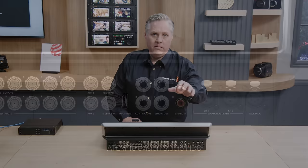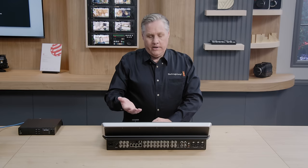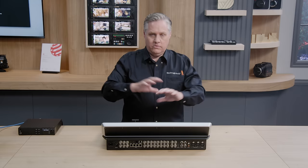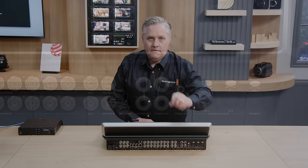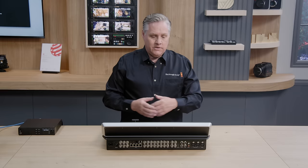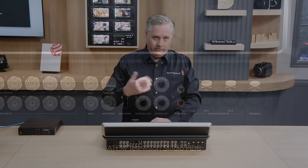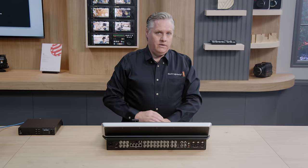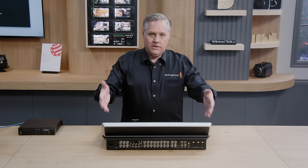It's got control room and studio monitoring audio. We've got one output for the control room and one for the studio floor because we've got talkback built in. You can use powered speakers with balanced analog outputs, and you've got audio monitoring control from the front panel. There are RCA outputs for connecting music — great when you're in a venue and waiting for people to arrive. There are also XLR inputs for line-level audio, allowing external analog audio mixes to be connected. We've used an industry-standard 5-pin talkback headset on this model — broadcast headsets rather than the aviation headsets on the old model.